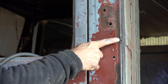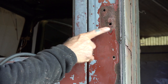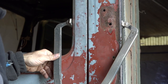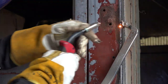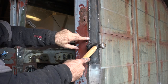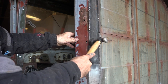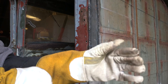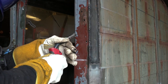Now I'm going to tag the panel in place with all these little welds all along the edge, and then we'll fill it up just like we did on the other side. Let's clamp it and weld a couple more. Put the panel in place and I'm going to hammer it a bit so I can make sure there's almost no gap between the two panels. Now we're going to weld it up just like before, with a whole bunch of small spot welds for the same reason — not to distort the panel.